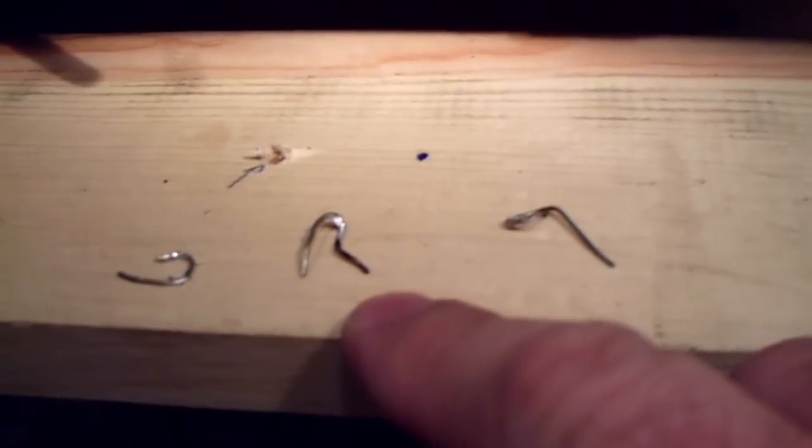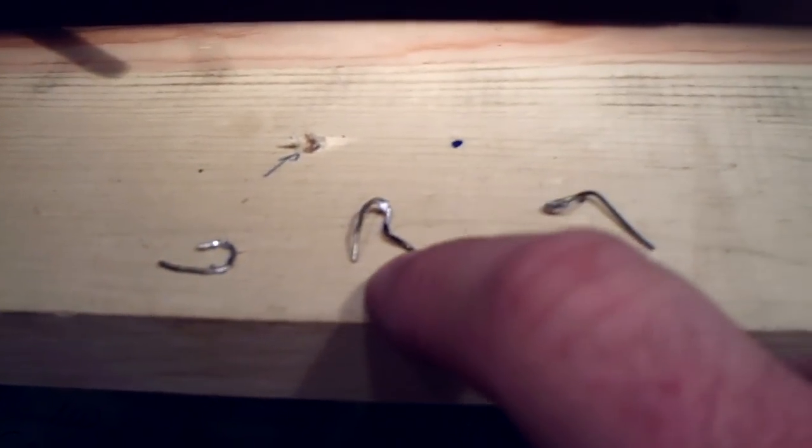These were hard to do, so I like the hook treatment - I made a little hook in there. What I do is cut the lead on the capacitor when I replace them, and these are the hooks that go on the terminals. That's one reason this took so long - whenever I could, I took the leads off the terminals to make a neater job. I made a little hook on the lead, got some heat shrink on it, then soldered it to the hook and it came out pretty good. Did both of those.